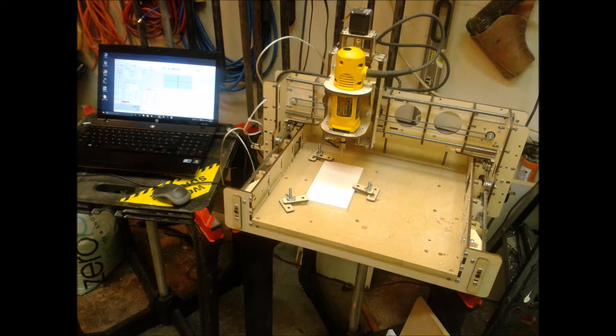What's most impressive about F-Engrave is it allows CNC neophytes like me to download graphic files — bitmap or JPEG files — and use them to create really great projects. All you have to do is learn to tweak a few basic parameters and F-Engrave will create a G-code file you can immediately download into UGS. Working with F-Engrave and UGS will help you learn and practice some fundamental CNC skills like homing your E3, setting the zero point of your workpiece, and the importance of things like speed and feed.